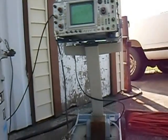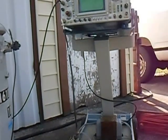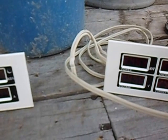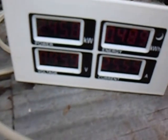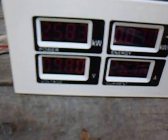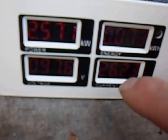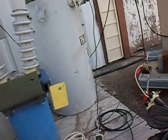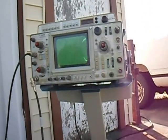So that's interesting — as you turn on additional loads, the waveform gets closer and closer to a sine wave. I was watching it, and I've done all these experiments before. The current coming out to drive all these loads right now: we're pulling 25.5 amps, 2.4 kilowatts — that's power going in on this meter. 26.2 amps, 2.5 kilowatts going in; 2.4 kilowatts coming out. We're not over unity by any means — we're under here.